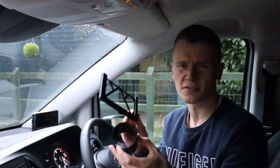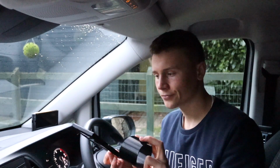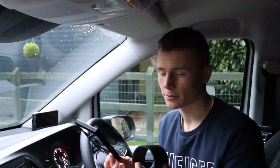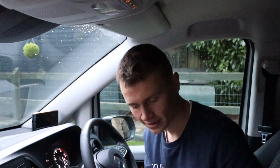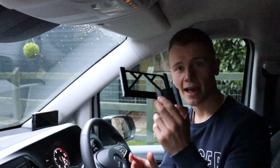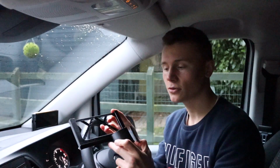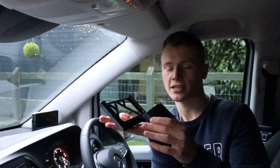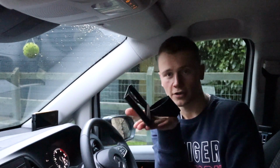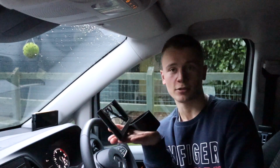This used loads of support, so it took about 8 hours to print. Printing in PETG, I didn't really want to use supports because they're a pain to remove, as layer adhesion on PETG is really good. So I went back to the drawing board and decided to angle the design so that I could, one, bring the phone holder into the bit to go into the cup holder, and two, completely remove the supports. So by printing it on an angle, you can make use of the fact that a 3D printer can print at 45 degrees without supports, and yeah, that was the result.